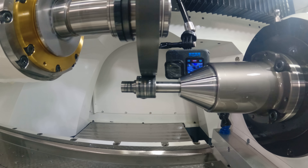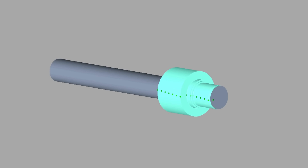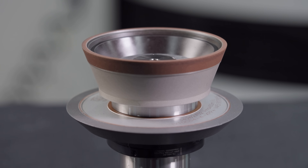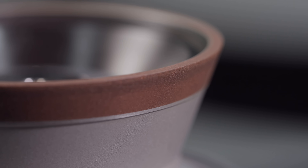This roughing operation is grinding out the steps and removing most of the carbide, so that when I come in with the clearance it doesn't take off too much. The clearance is done with an 11V9 wheel, which is great for fine detail work but not meant to remove a lot of carbide. That's why I'm using the roughing wheel to get the part down to size first, so I can finish it with a nice clean cut.